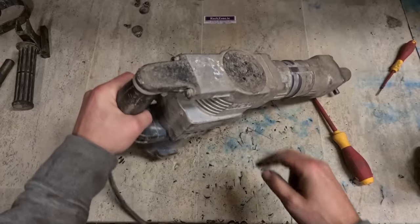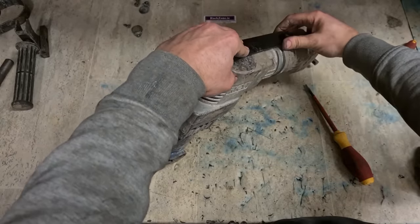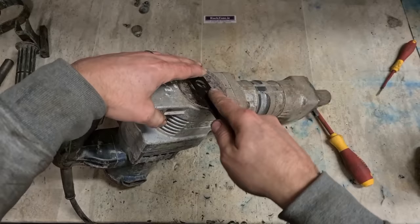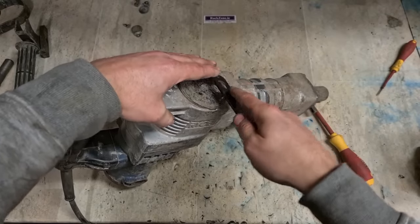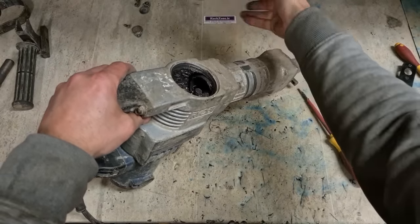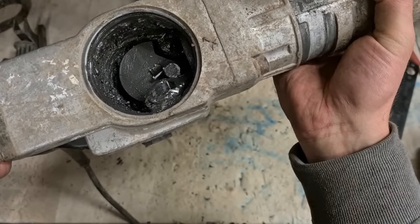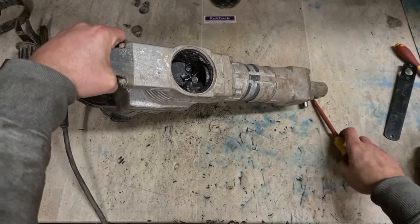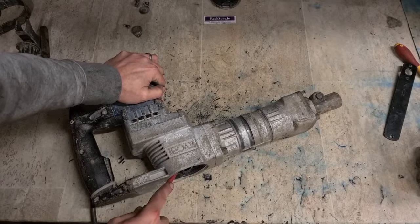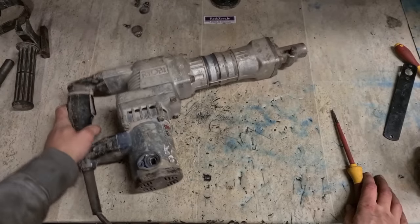Right, see what's going on up here. Let's see, it was cross-threaded, like it was jammed on the O-ring. Ah, there's a problem. That's why she's jammed, all right. She's trashed the needle bearing, and now she's jammed on the piston. That ain't budging. So, full strip for this. But before we do that, see if we have any parts for it.